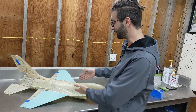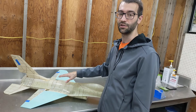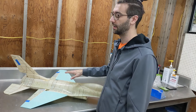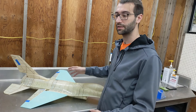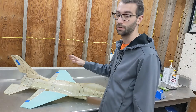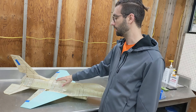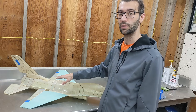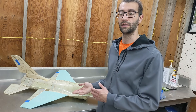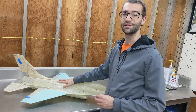Here it is assembled in all of its glory with all of the structural pieces built to date. There's still a lot of little things to do to finish up the airplane, but that's going to wrap things up for this video. I'll have one more video coming out before the maiden flight, where I'll be finishing up all those little bits, getting the airplane painted, getting all the 3D printed pieces attached, doing taxi testing, and running a pack through the plane on the ground to make sure the ESC doesn't get too hot — because I'm not using cheater vents, so I want to make sure the inlet duct I designed will supply enough air to the EDF. Thanks for watching, and I'll see you next time.